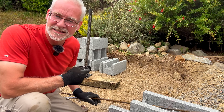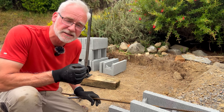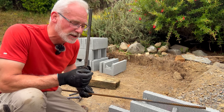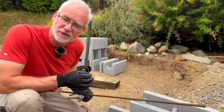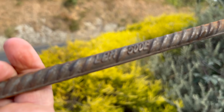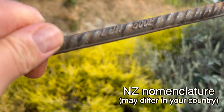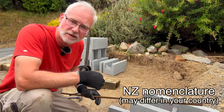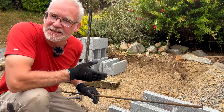Time to test out the rebar bender that we made. We tested it in the workshop using a piece of half-inch, 12-millimeter diameter solid round bar — mild steel. The rebar we're using is also mild steel but it's high tensile. In this country the rebar is designed for seismic activity, so it comes with a tensile strength denoted by a number. You can see imprinted on the side of the material '500E' — that designates this as the highest tensile strength rebar available, and this is going to help our wall be really strong. But does the rebar bend? Let's find out.